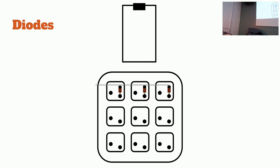So that wire just runs across. Yeah. So if you want to wait, that's fine. Once you have them lined up, go ahead and take your soldering iron and solder that loop. Add the solder inside of there. The loop should help, through capillary action. It'll fill up and then make a really good connection. Should we just do one row at a time, or should we put them all up? I do one row at a time. Yeah, one row at a time is easier.